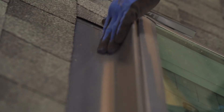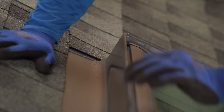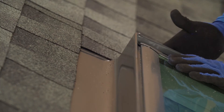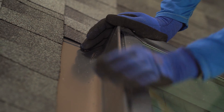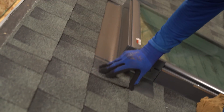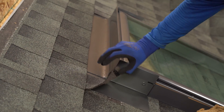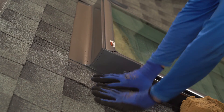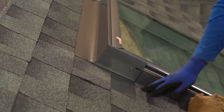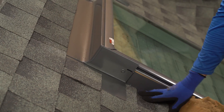Here we are — it's all complete. If you notice on my edges, I have about an inch there. I like to have extra space for the water to run off the sides, as opposed to having your shingle all the way tight to the edge. Even though I had a splice very close to the edge, I still don't have any nails, holes, or penetrations — a perfect area for the water to channel down towards the roof.